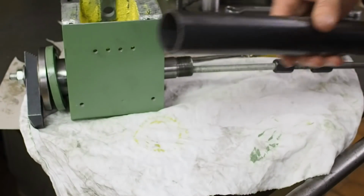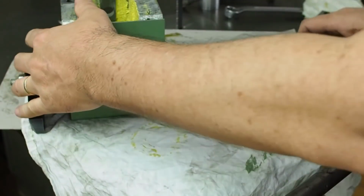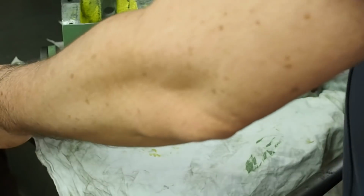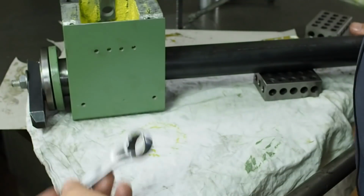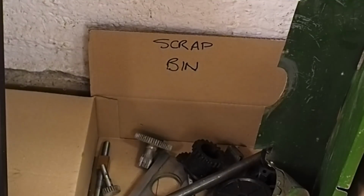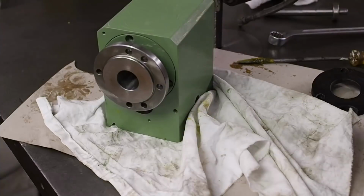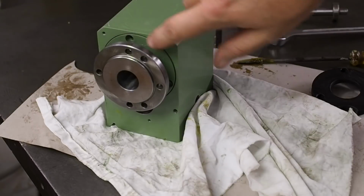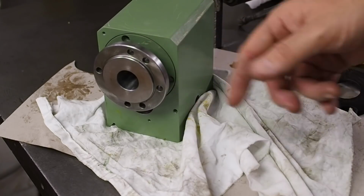Just put a steel tube over to press against the bearing. A 1, 2, 3 block under there gets it pretty much on center height, and then it's just using a wrench to seat the bearing. Oops, first scratches in the paint already. Back when I first did a bearing change years ago, I didn't undo those 3 screws on the front dust cover before I pressed out the spindle, so I basically pressed the spindle through the plastic cover and destroyed it.